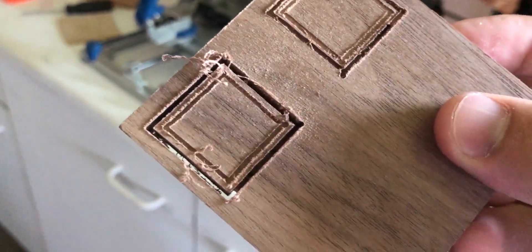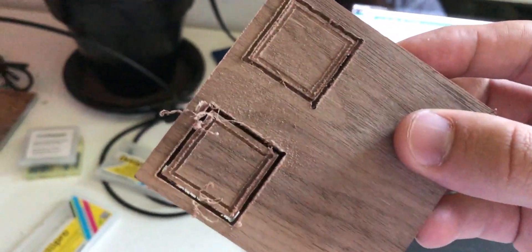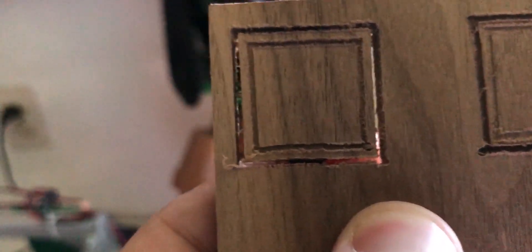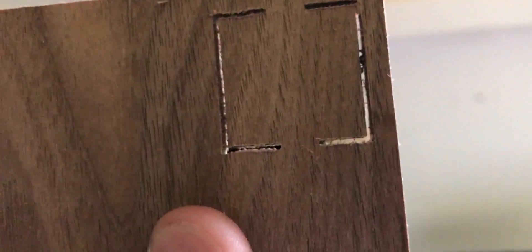Take a look at what we're working with — shake the sawdust off. That looks okay, not the best, there's a couple burrs. Progress has been made. You can see right here at the bottom-right corner there's a little bit of work that needs to be done on the feed rate — I think I'm still pushing it a little too high. I did decrease the feed rate for this attempt, and it looks like we got moderately better edges, but the whole machine is under a little too much tension. I think the tabs to prevent floating islands worked really well, carved out at exactly the depth I want — that is a very easy cut with a handsaw. When we had a plate of four done, we'd be able to carve four and then take them downstairs to the laser engraver to engrave the numbers on them for the tokens.